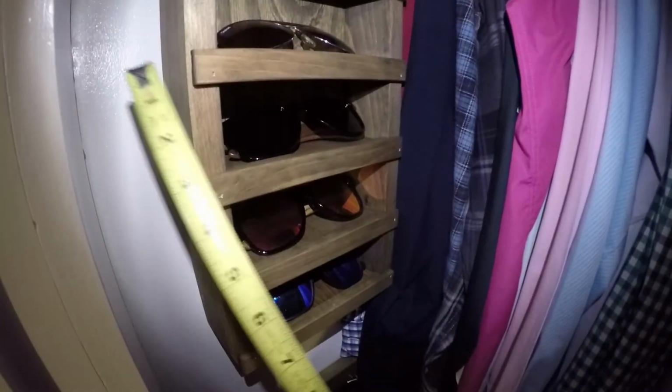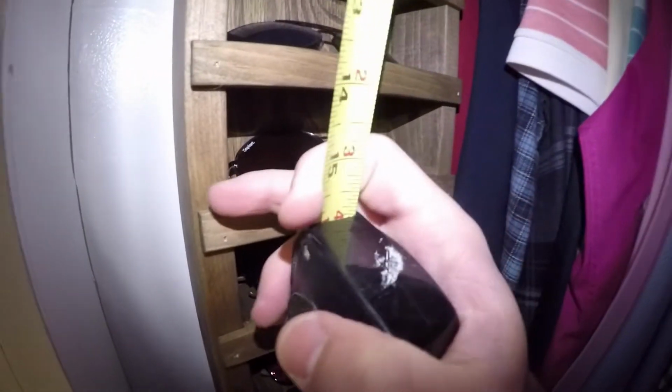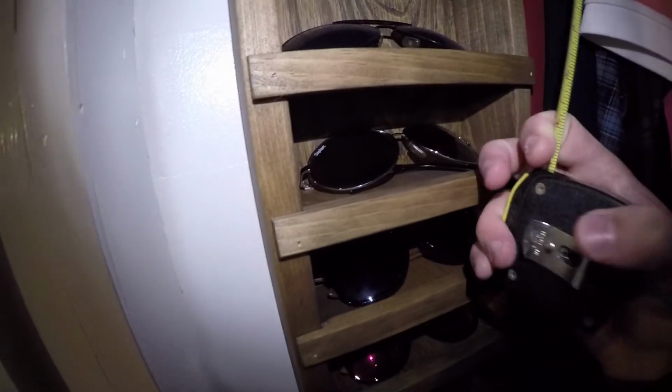The other thing we're doing is notching the back corner of this 1x4 so that the back panel can sit flush against it without seeing the trim here in the corner the whole way around. And these 1x4s here that I have at 9/16 width, we're going to notch these corners so that it flushes out on this end panel really well. And we're also going to notch the back of them so that the shelf can sit in the back of these and support them.